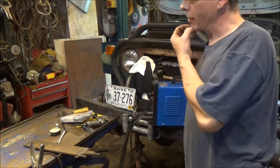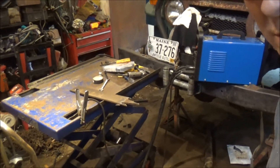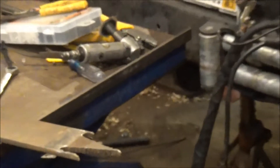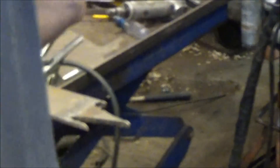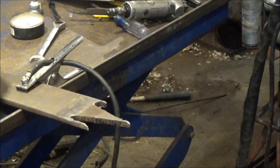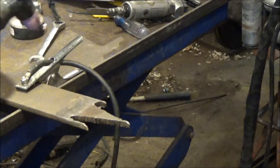So far so good. I've got a piece of 3/8" plate here, all cleaned up and ready to try this thing out. We're going to see if it will reliably cut some 3/8". Previously it was spattery and not working great. Now she's set on 50 amps, the air is set — let's see what happens.